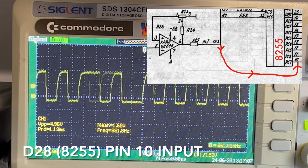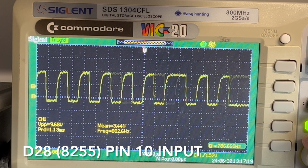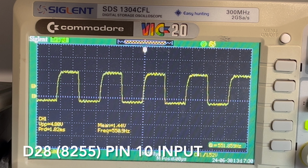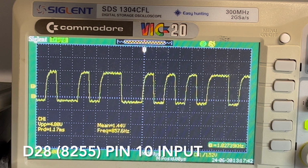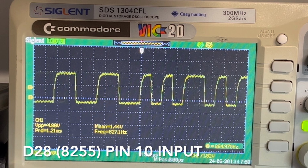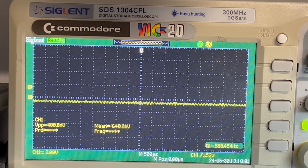All right, so that looks decent, doesn't it? That looks all right. A little negative. So that's 2 volts, so that's 5 volts. Yeah, it's basically 5 volts. That looks okay, doesn't it? Nicely formed. I assume we've got a whole string of zeros or ones or something. So it does look like the data's getting in there. That looks okay. A little negative. It's a bit strange how it goes a little negative like that. And then it's stopped.